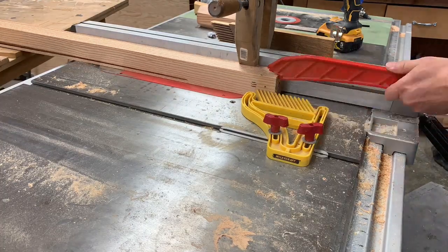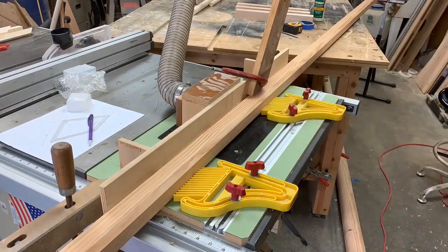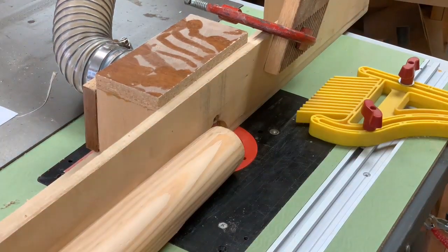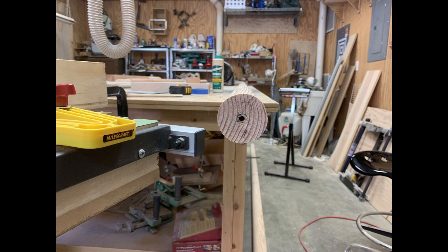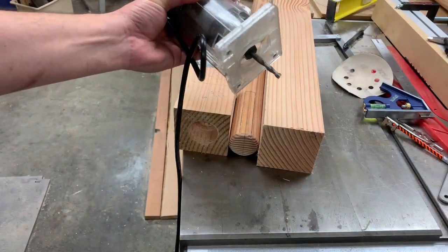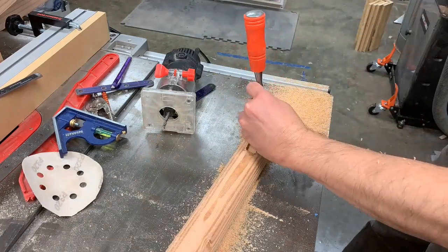I had searched the internet for a way to make this square into a round. I had started out with a jig that was supposed to allow me to spin the square over the saw blade of the table saw to turn it round, but that didn't work, so I moved on to this router bit that has a 1 inch radius — and this method worked beautifully. To connect the boom to the gooseneck fitting and the mast, I need to inlay a couple of stainless steel flat bar pieces. I've laid those pieces out on the boom and marked around them, then used the palm router with the spiral bit in it to make the inlay.